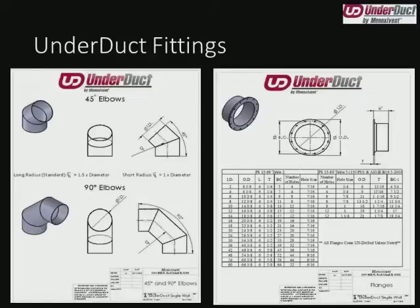When we change into underduct elbows — that's our standard HVAC direct burial ductwork — you see that the 45-degree elbows are now all two-gore and the 90-degree elbows are all three-gore, regardless of size. Because of the properties of the different resins we use for the low smoke and low flame of HVAC ductwork, these underduct elbows have fewer gores than the corrosion composite elbows. Over here on the right, we see one of our standard duct flanges. All the dimensions come from this table — PS standard 15-69, table number two. Most of these flanges are two inches across the face from inside to outside, and anywhere from an eighth inch to roughly three eighths thick, depending on size.